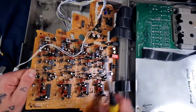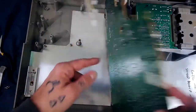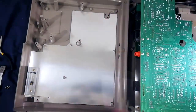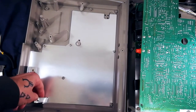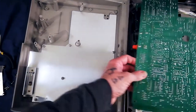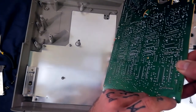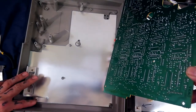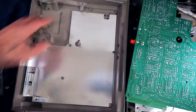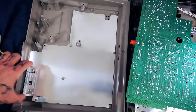At this point, tip forward from the front to allow the tips of these two quarter-inch jack sockets to clear, and the board will tip out, giving you access to the underside. Notice the shielding has a folded bit underneath — don't confuse yourself into thinking it folds back over the top. It does need to be underneath, because there are exposed metal contact dots there meant to make contact. Leave that folded underneath and sitting on top of the mounting post.